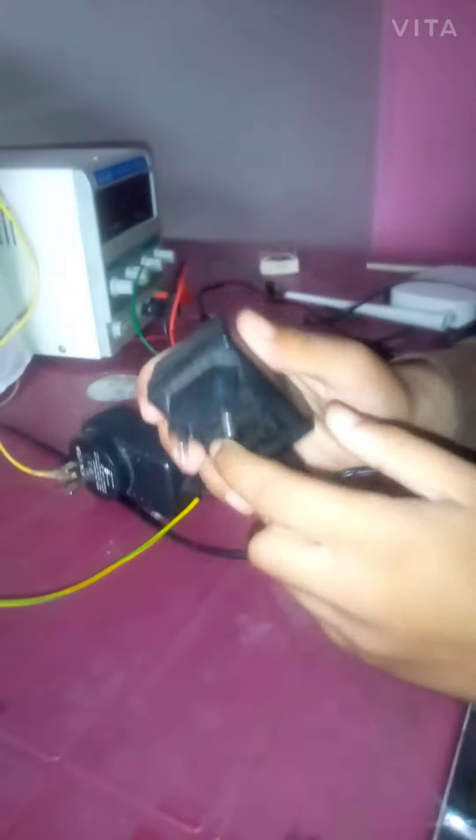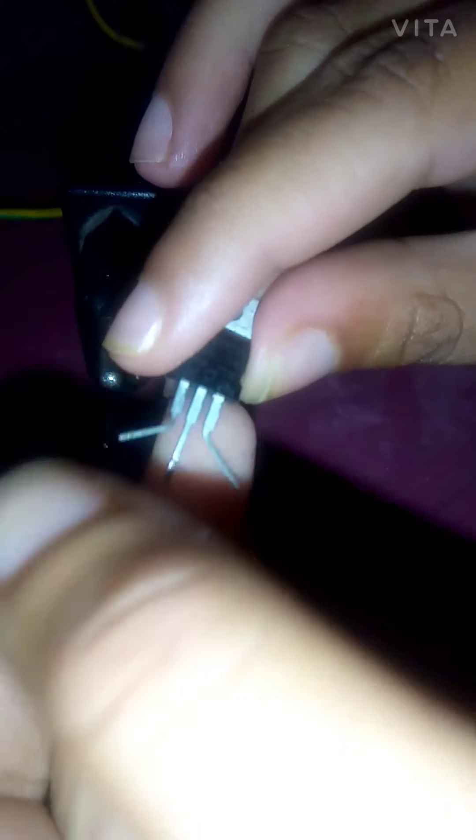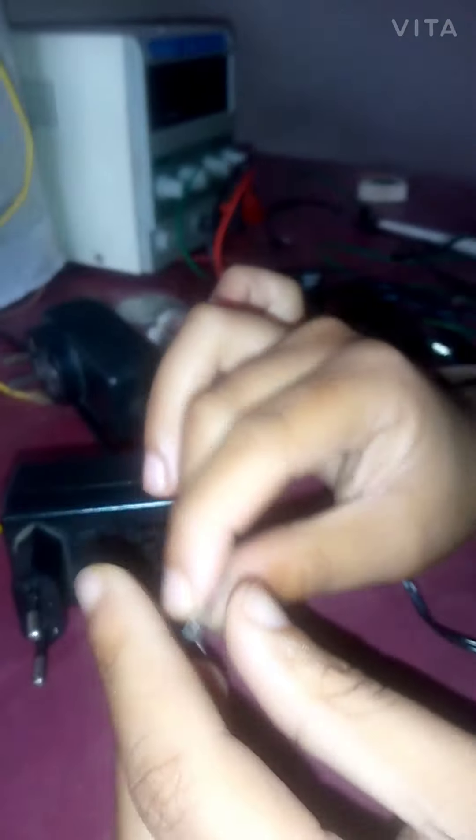The problem is this Wi-Fi charger is 9V and the replacement is 12V. That's why I will use a voltage regulator - the 7809 voltage regulator. It has 3 pins: input 12V, and output 9V, dropping within 2V across the regulator.